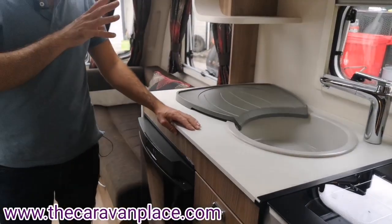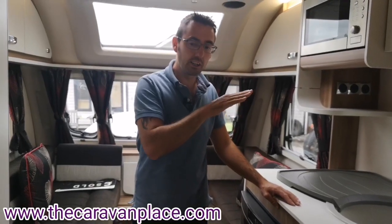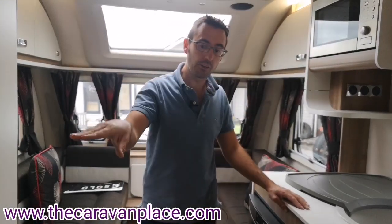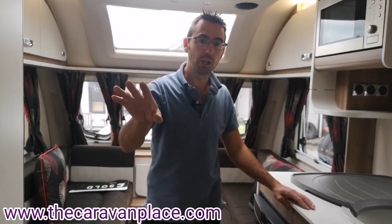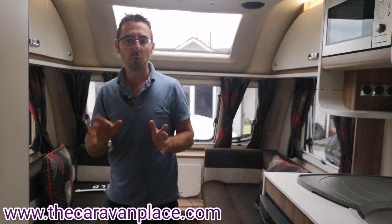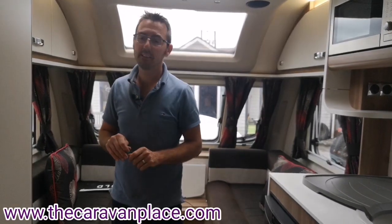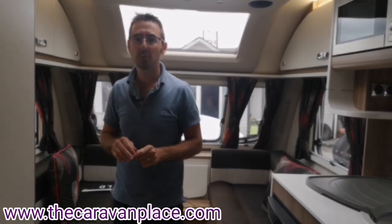So once we've got our system full of water and we've done hot and cold, we'll have to do the bathroom sink and the shower, because it works on a pressure system. We can then, once we've got all the water through and all of the air out of the system, put our heating on and our hot water system.